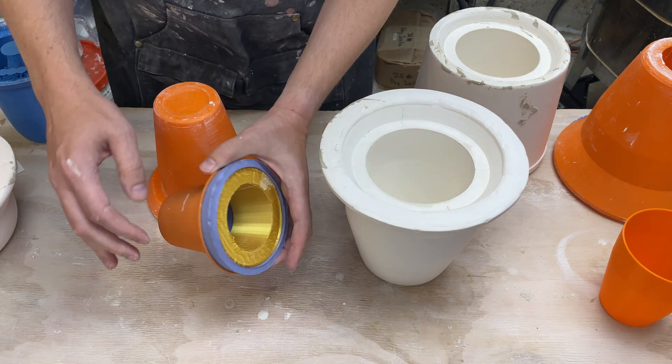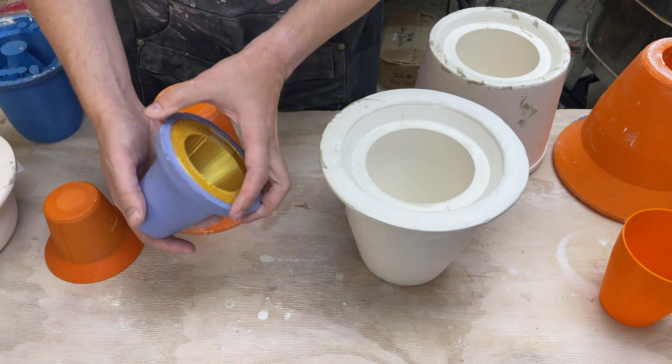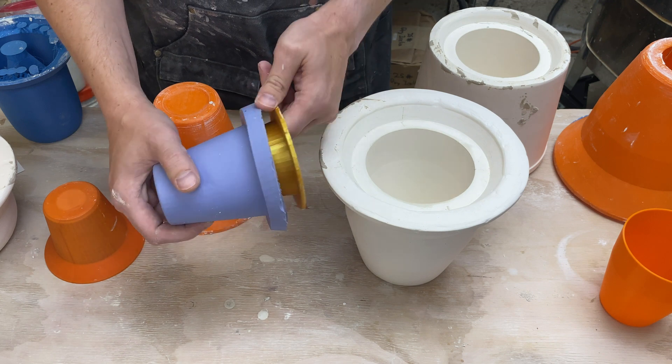Much like pouring plaster, we have an outer mold, an inner mold, and we pour silicone between them. We can then get rid of the plastic on the outside, leave the one on the inside, and pour plaster around this. We pop this piece out, and the silicone is very bendy. When I designed that mold manually it was tricky — you're constantly thinking about positive and negative spaces, the pot, the plaster, and now the silicone, which face you want to keep, and all the offsets needed. My software now handles these offsets pretty much automatically, so this would be one more layer deep — another offset for the silicone and another pair for a 3D printed mold.